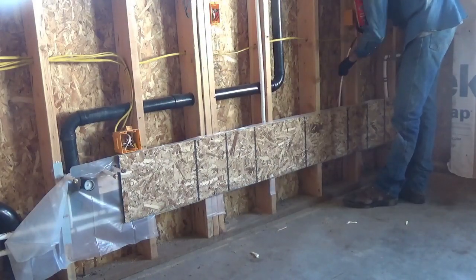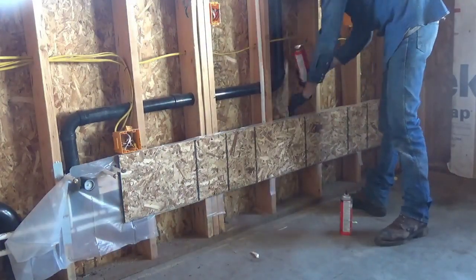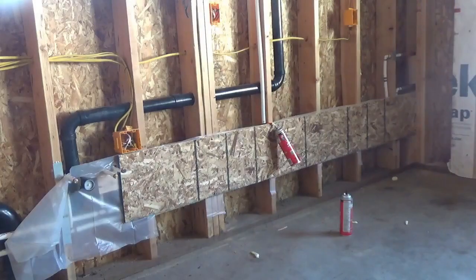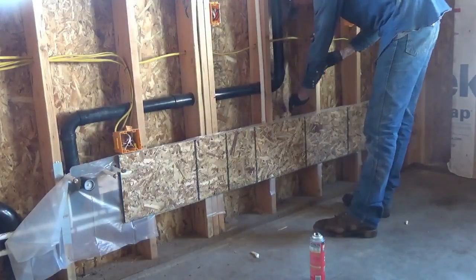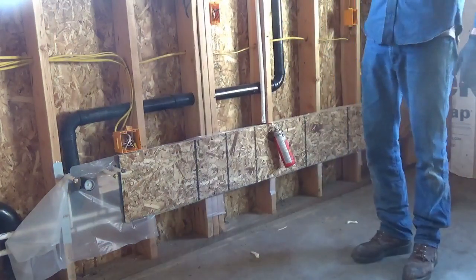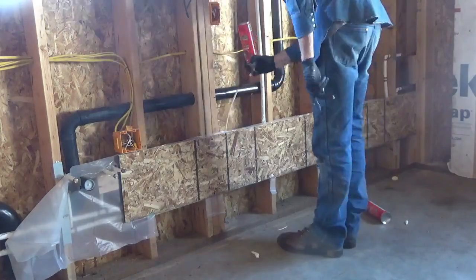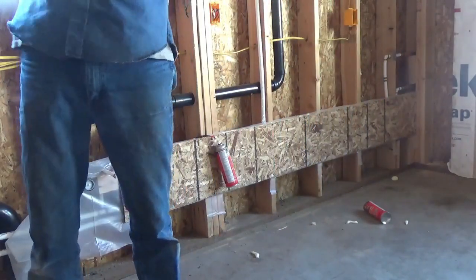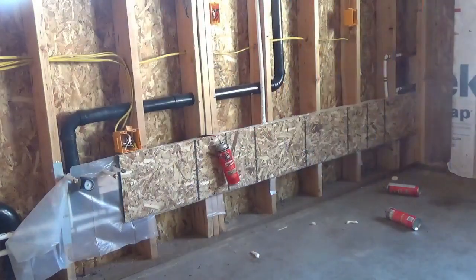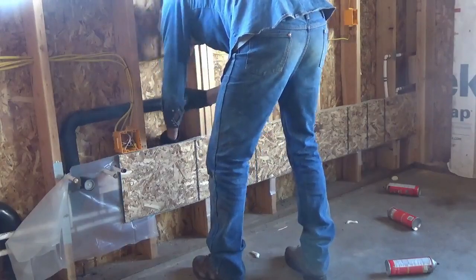At three dollars and twenty cents a can I'm investing a little bit of money to do this. But to think that this is where my cabinets are going to be in the kitchen — to spend 150 bucks to prevent the idea that I would ever have to tear those cabinets out to fix a pipe — is money well spent. This is a little bit of an experiment, but if it works out the way I think it will, I should be able to remove this board, put Roxul insulation above and below the spray foam, and put drywall right up against it and be ready to go.